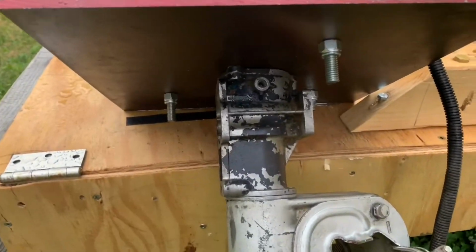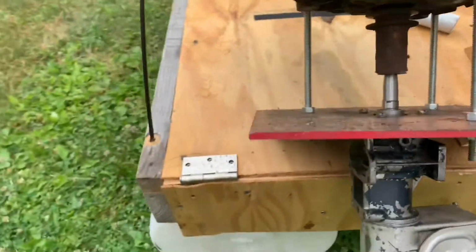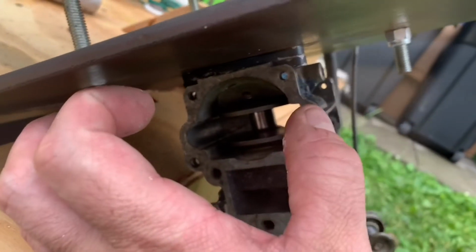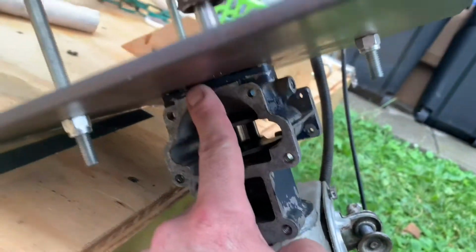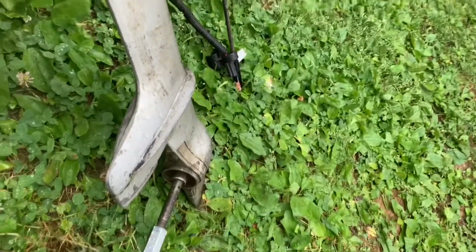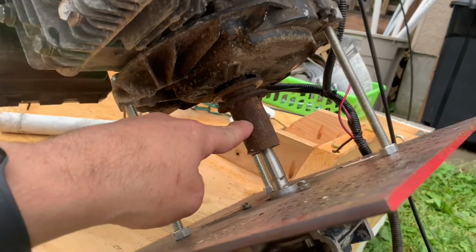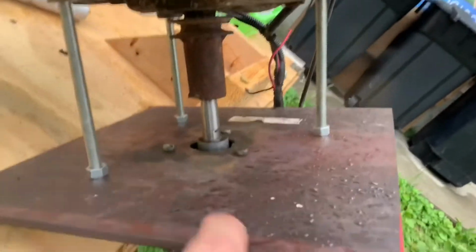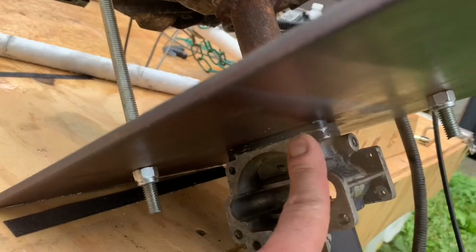But when Jay took apart the Hiawatha motor, we realized that it would be better to just take the head out, take most of the components off the motor. This would keep everything the same, the measurements of the shaft and everything the same. And it just turns out that the end of the shaft threaded perfectly into here. It was like some miracle. So basically I just took a plate of steel, templated it out, drilled the holes so that these guys are connected.